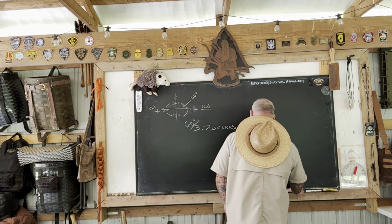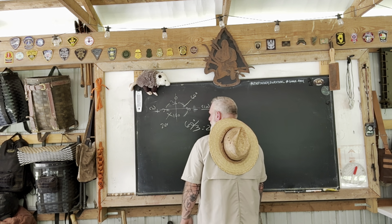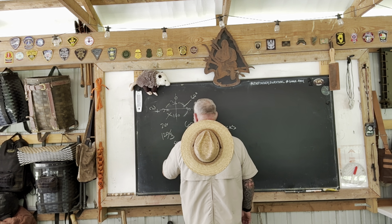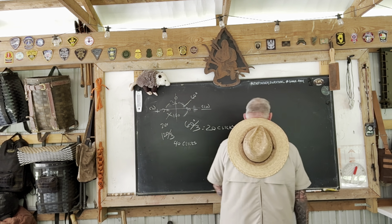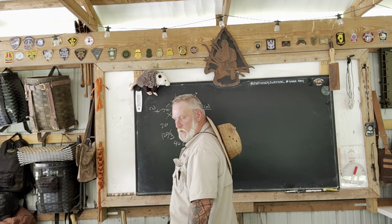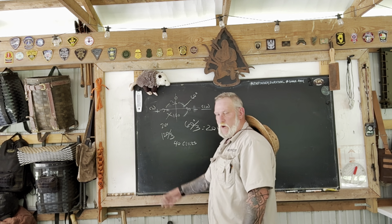Let's say this time we want to move to 240. We take 240 from 360, that is 120, divided by 3, 40 clicks. All right, 40 clicks. Now, this time, we're on this side, we're going clockwise, remember that. If we are more than 180, once we divide by 3, we're going clockwise.